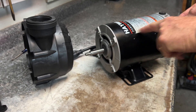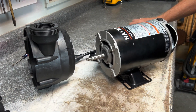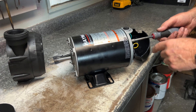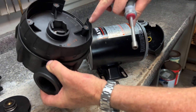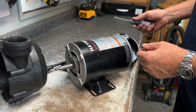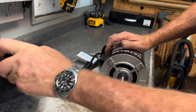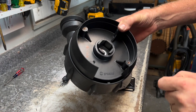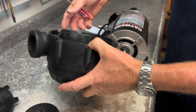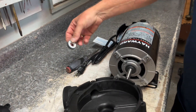The reasoning for keeping the screws in is they're sticking out, and if we pull this out it's very difficult getting those screws to line back up. Now, if you've got a nut driver and this does not want to turn, I have seen these get rusted into the grommet. If that happens you can actually shear it off and break it — a whole other problem. So if it won't come off, I'd recommend taking a screwdriver and prying it out instead so you don't break the bolt. Using my nut driver I'll just tap that and remove the inner seal.